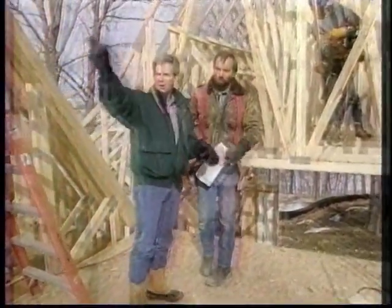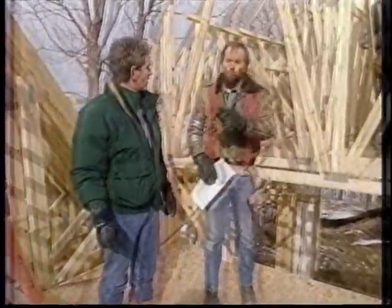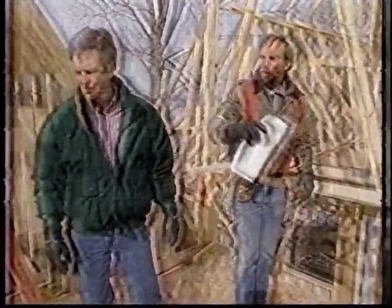Now, obviously, these two roofs here get trusses. Is this whole area going to be trusses, or? Everything from where we're standing right here to the end of the house is stick frame. Okay, how about the front entry area here? Front entry is hand framed as well. Okay, but trusses over the great room here then? That's right. The great room is all truss built, and then everything over the breakfast room, the kitchen, and the dining room are truss built.